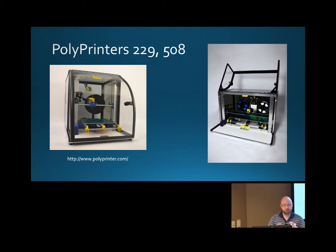The key with printing with plastic is you want it to cool off slowly. For ABS, we're heating it up to 270 degrees Celsius, and we want it to cool down slowly so that there's no shock to it. It's a little bit like when you have glass and take it from really hot to really cold and it'll snap, and plastic works in a similar fashion.